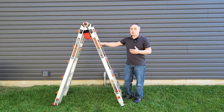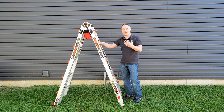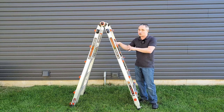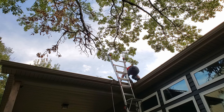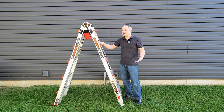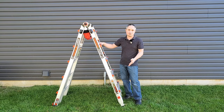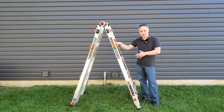Overall I think this is a fantastic ladder and I'm really glad I bought it. I was initially worried I got too big — I went from a Werner 17-foot to this one. In extension mode, I recommend if you've got a 10-foot ceiling inside a one-story house, get at least the 22-foot version; for a two-story house, probably go with the 26-foot. I actually feel secure getting on my roof now in a way I didn't with the 17-foot. The extra features like the wheels and leg levelers are absolutely worth it. The leg levelers are one of my favorite things — when you're outside on unlevel ground, you don't want to find a two-by-four to prop it up unsafely. I highly recommend this ladder and would not skimp — get the one with the leg levelers.